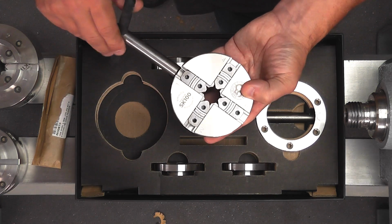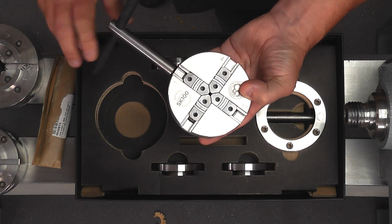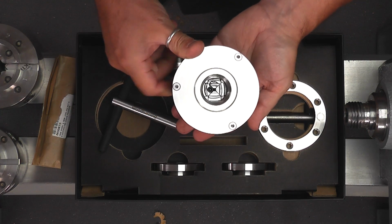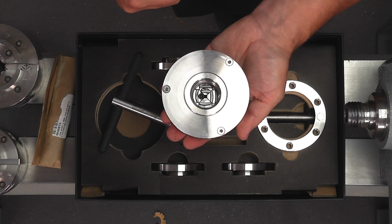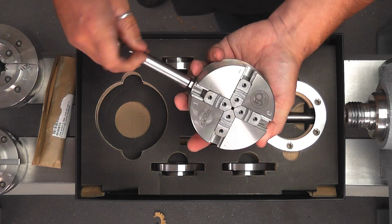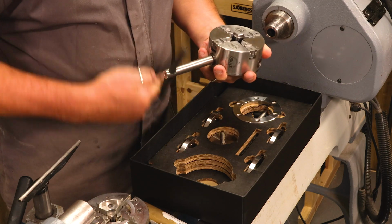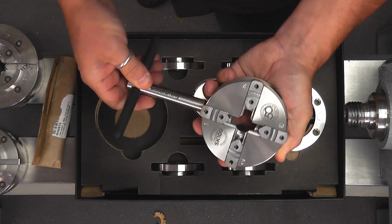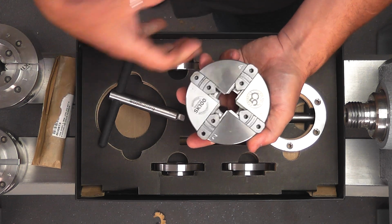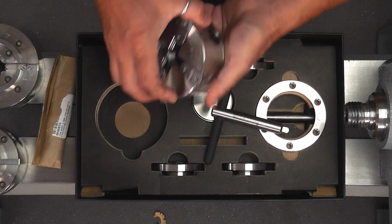These are softened edges, so hopefully if your fingers or knuckles come into contact, they're not going to cut you. But one thing I want to show you by moving these all the way in, this is our safety jaw feature. You can see in the back there, you can see that little screw down the bottom. That means that you wind the jaws all the way. They're not just going to fall out. You can quite easily take that screw out if you want to remove your mounting jaws. But there we are. I can't go any further, so I can't have an accident unwinding them a little bit too far and then suddenly turn the lathe and everything flies out. So really, really good little safety feature, that one. So that comes as standard on all of the chucks.